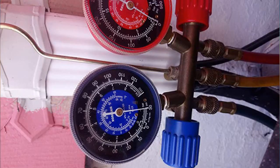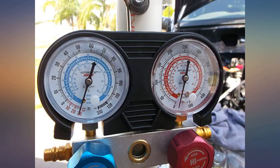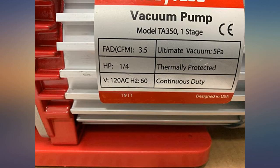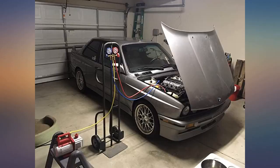I am very satisfied with this pump. Works perfect for me. I was tired of lugging my heavy 12 CFM pump for small jobs, so I bought this unit to vacuum small refrigeration systems. I use this to vacuum small systems like wine coolers, dorm refrigerators, and boat refrigeration systems, and it works very well for that purpose. I decided to use it on a 1.5 ton residential heat pump and it pulled down to 30 Hg in no time.